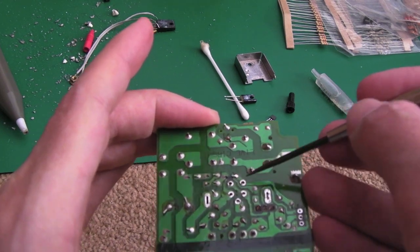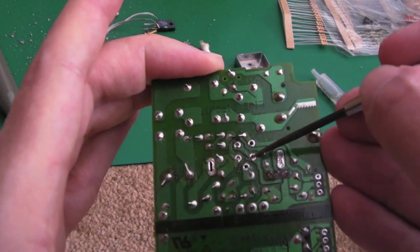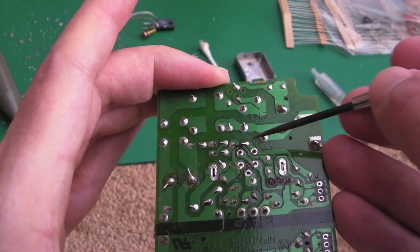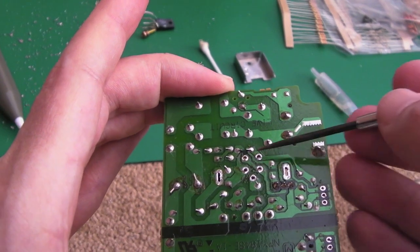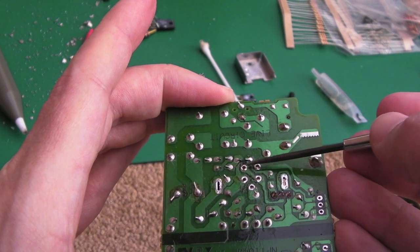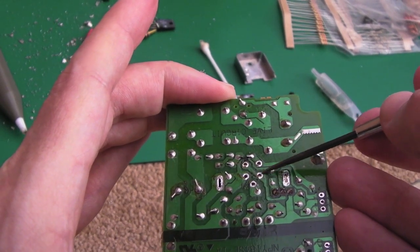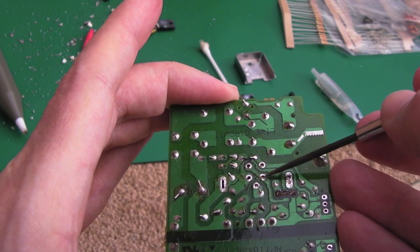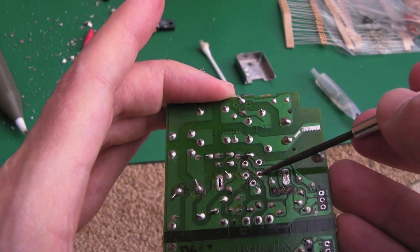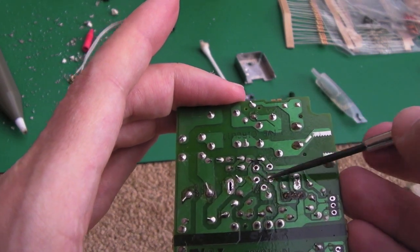You know, if you measure it now, it's a short circuit, that's correct, and it's feeding one of the pins here of this transistor. So it's quite clever the way they've done that. It's just an extra safety protection that if the transistor shorts and gets too hot after a very short period of time, it'll go open circuit and it will cut the feed to the heatsink. It must be perhaps the collector or something going into that transistor. But anyway, yeah, so it measured okay.